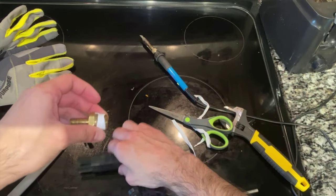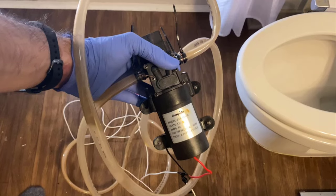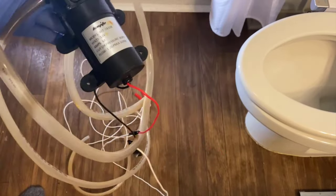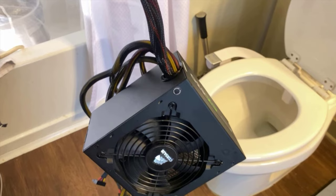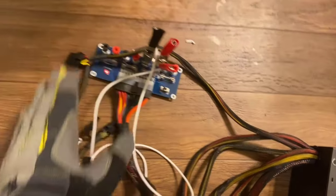One thing I learned is adding PTFE tape on my fixture threads definitely made my fixture much more secure and avoided leaks. You're going to need two tubings — one connecting to your fixture, and the other connecting to your reservoir — all with your pump in between. Zip ties can work well as a clamp, and twist tie and copper wire works better. Make a sludge filter, connect it to some form of power — I use an old ATX power supply with a breakout board — add salt, do a quick little test run, and see if there are any leaks.